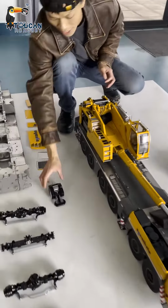And this one is the steel hook. You see the rollers, totally 5 pieces. Imagine you have 10 kg on the wire, you will have 110 kg lifting power. So it is powered 11 times. Okay, see here, that's the main part of the truck.